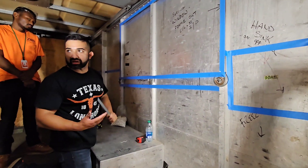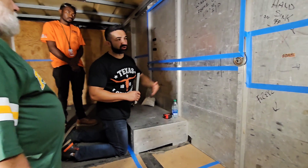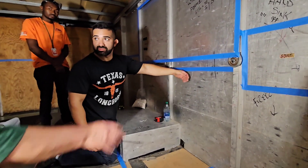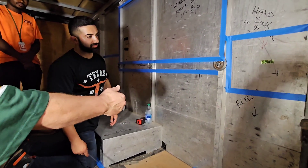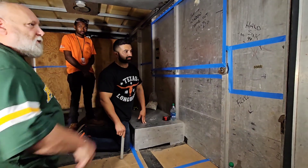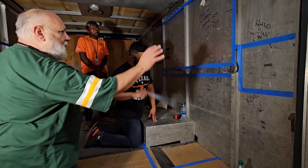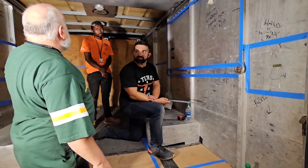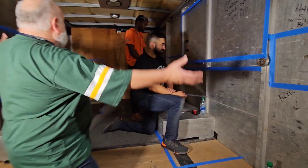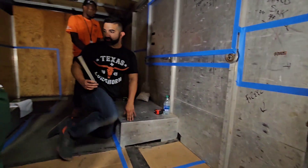Since they are master metal workers, they can frame this out and make it a lot sturdier than what I use with wood. They won't really use wood besides for backing. The interior will be insulated with rubber for noise, and then skinned with 22-gauge 304 stainless steel — on the passenger side, the driver's side, the ceiling, and the front bulkhead. Everything in here will be stainless.